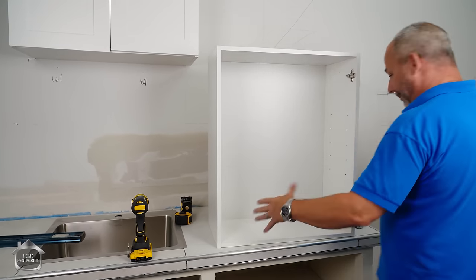And then we're looking now for a drill bit that's wider than the screw. Okay, so we're gonna go over here. Oh, that's perfect. 3/16. All right. Double check. Is a 1 1/4 gonna hit anything? The answer is no. Good to go. Once you have got everything level and square, then you can drill holes, not before.